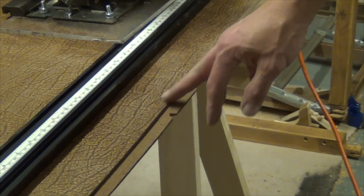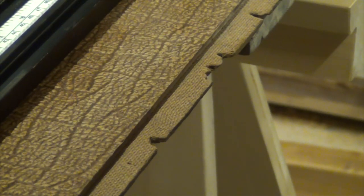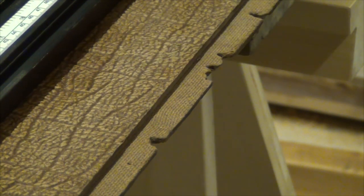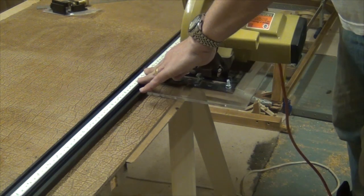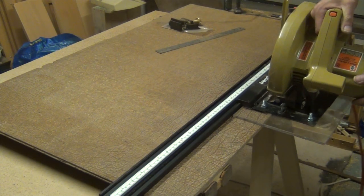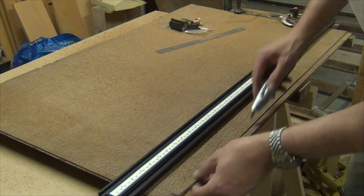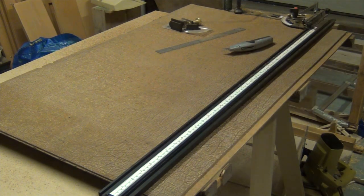The front and back panels are tied together by side panels, which intersect with the corner posts using a tongue and groove joint, where the tongue's made up of a sandwich of hardboard. It's really worn out over the years and doesn't function very well at all, so I'm creating a brand new joint. Hopefully rounding the edge off will make it last a little bit longer this time.